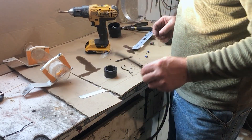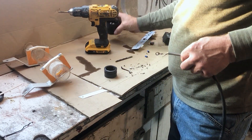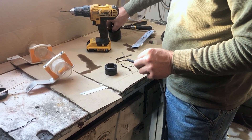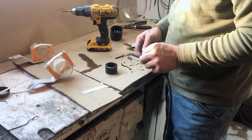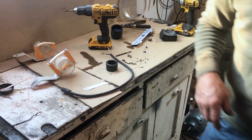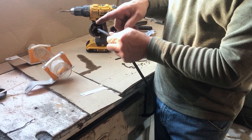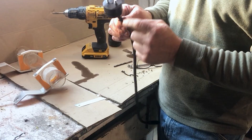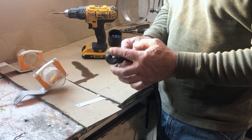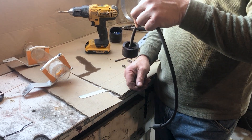I removed the old cord with the high pressure plug connector — it was attached to this, now it's not. I've crimped on some new ends; there's no need to shrink-tube them or anything because it's all encapsulated in epoxy. Now all I have to do is run a couple of bolts through there to attach this. These two wires are now underneath those bolts so the power travels through them, and then I connect my leads right here to the inside positive and negative.